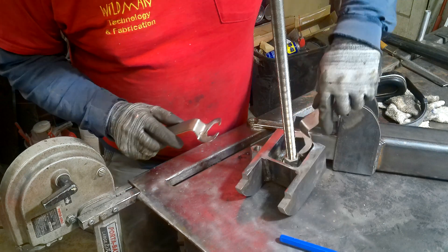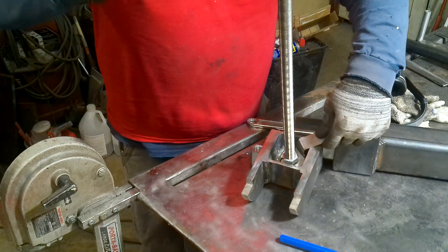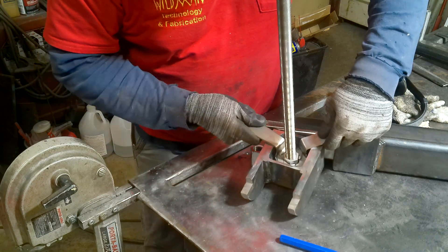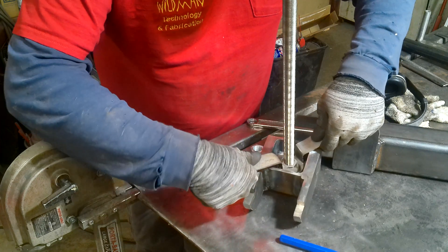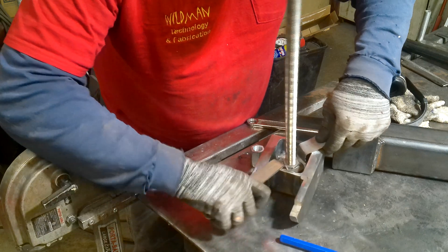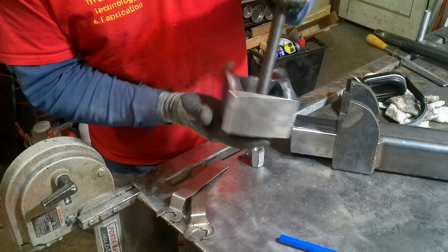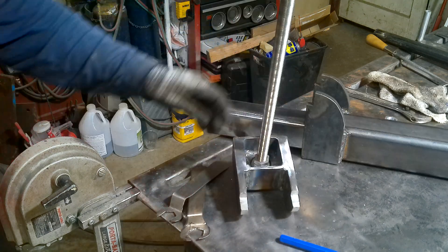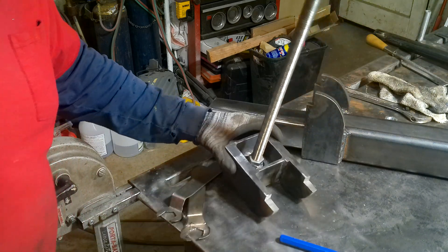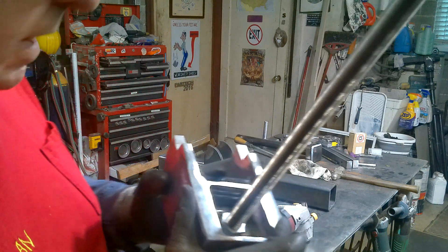I've made a couple of sheet metal wrenches to get in there on those jam nuts. This was one of the problems with the last rendition — I had no way to tighten these jam nuts. Now that's nice and tight, but it's also quite filthy in there from weld spatter and stuff. I'm going to take this apart and clean that out. Now that's quite a bit cleaner and it will slide over the end.